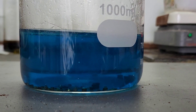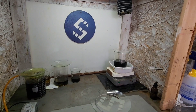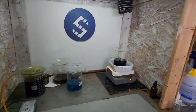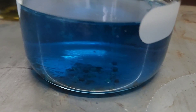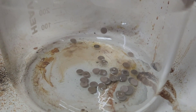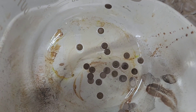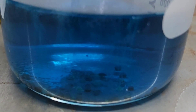I'm finishing up my potassium nitrate cooking in the back. We'll put a little heat on this to see if that speeds it up. Checking back: I just finished my potassium nitrate with hydrochloric — the poor man's aqua regia — and I've cleared up all of those big contacts. They look really nice, no more base metals. This citric acid batch has just been chugging along all weekend, real nice.